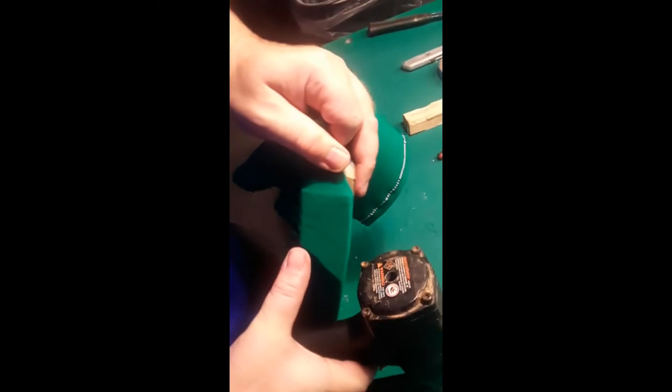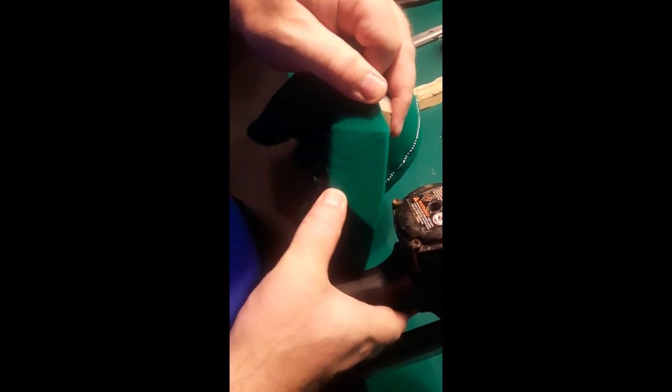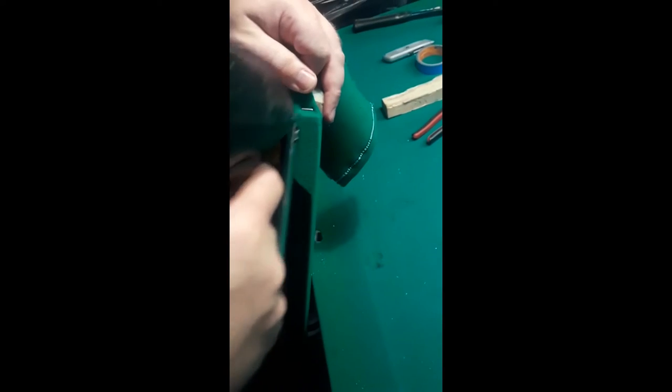This is the end rail. What I end up doing is I take this little bit of extra cloth, tuck it underneath, and pull this way. You see that almost all that puckering disappears almost completely. Then I'll put a couple staples right there to get that finished part and then I'll be trimming off the excess.